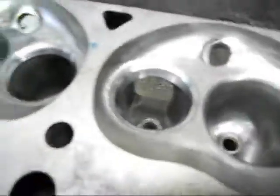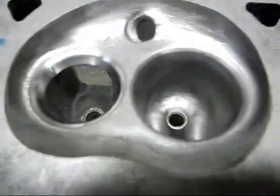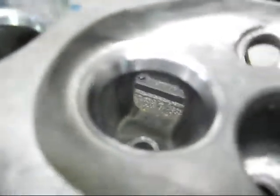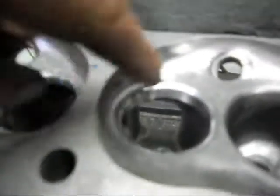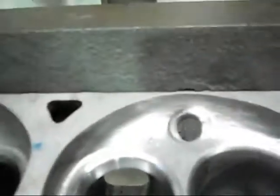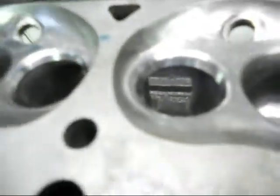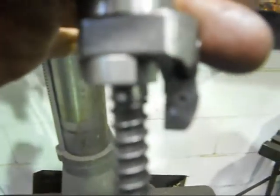We have here almost the completion of all the seats done. What we can do now is actually just blend in that edge from the inside diameter of the actual insert. I have this tool that I've ground up — you can see it on the white background. It's actually about 70 degrees, that angle down, and it goes to a radius. So I'm going to feed that down and clean up that inside diameter of the insert. It will blend beautifully into the throat.